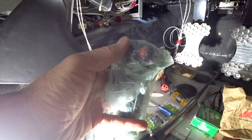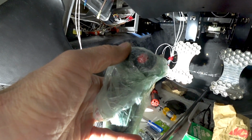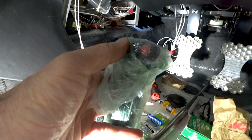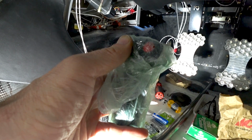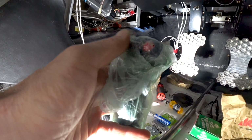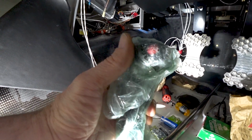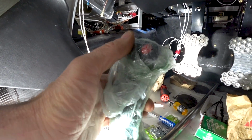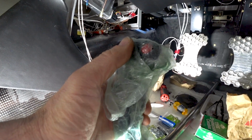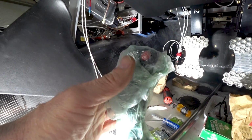The left and right on that hat will be the aileron trim, which obviously doesn't work like that. It has that little trim tab that we have there. But just pushing up and down on that, and as I said, initially I had that around the wrong way, so all I had to do was switch the wires around, because it's just power in one way and power the other way, and it makes it work in the opposite direction. Anyway, that job is now done.